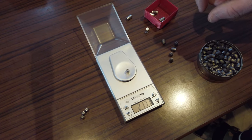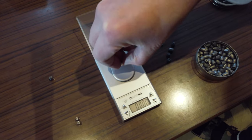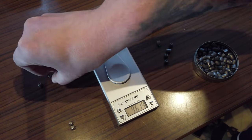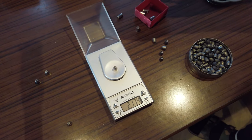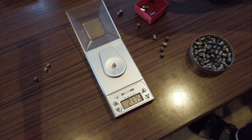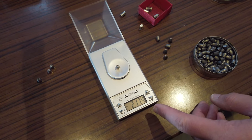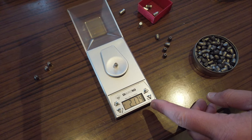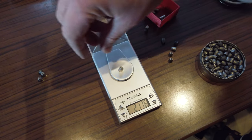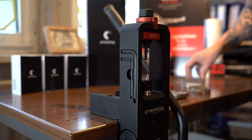Now I grab ours. We almost produced the same weight — 2.177... That was not on purpose, absolutely random. Another one: 2.177... 2.174... 2.175... You see, the tolerance of my freshly produced slugs is around 3 thousandths, while with the commercial ones the tolerance was around 30 thousandths. This means this press produces the slugs extremely, extremely precise and repeatedly, one after the other.